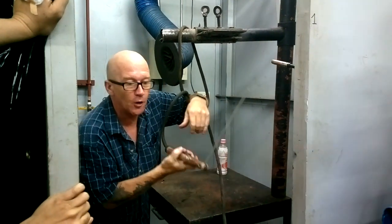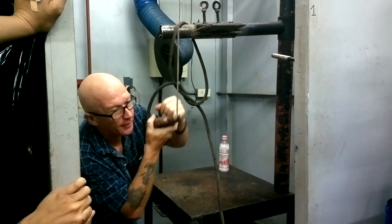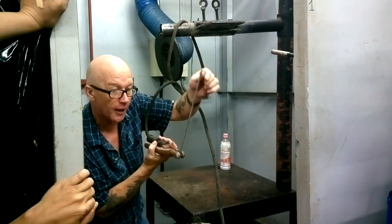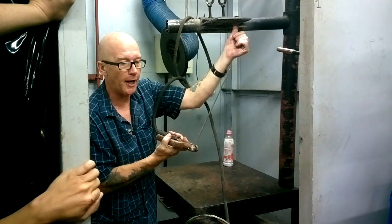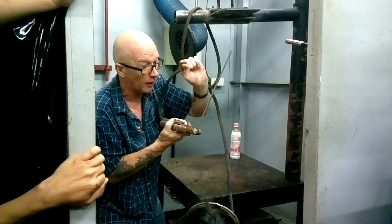The thing about comfort is when you're freehand, you're getting fatigued on the overhead. And you're shaking, so you're losing your arc, because you're pulling away — your long arcing. But when you're long arc, your temperature goes up. So then you're making a mess because you're too hot. So you've got to keep a tight arc. You've got to keep it in there tight — the arc, the stick.